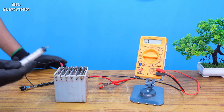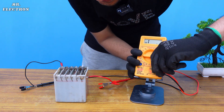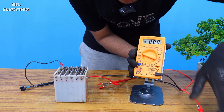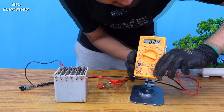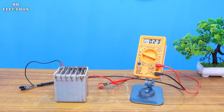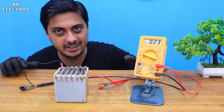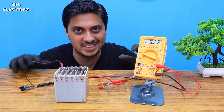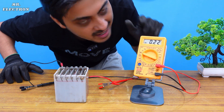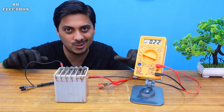And go — oh my god, it has crossed 200! Let's switch to 10 amperes and see: 0.24, that's 240 milliamperes. That is so cool. There is no pH stabilizer present inside the battery right now, so it is going to oxidize soon. But you can see the maximum current produced is 240 milliamps. It was 240 and now it's 220, but still quite good because it is also under short circuit.